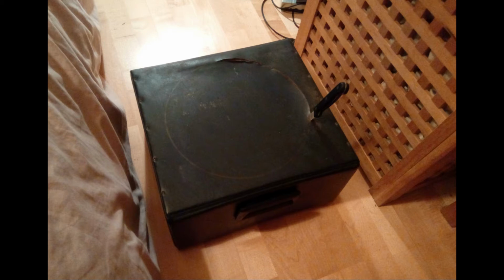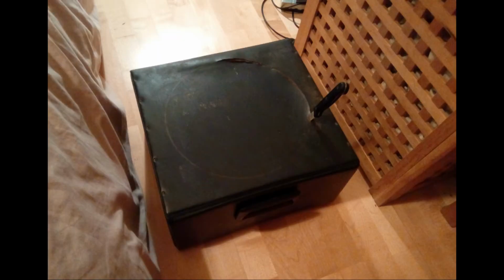Definitely a bargain. The first step after having procured the box is, of course, to cut the hole in the front. Once again, I used a plate which is slightly smaller than the diameter of the speaker, so it wouldn't slip through, and used that to trace around in order to cut out accurately. And then, once again, attack the box with a kitchen knife that was just about the right sort of width that you could actually turn it while cutting.